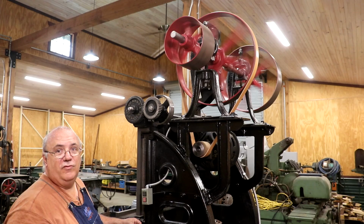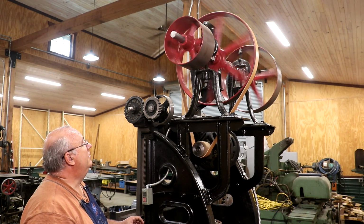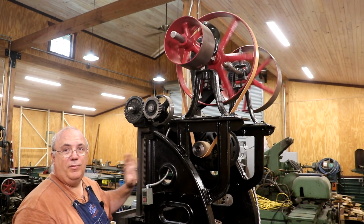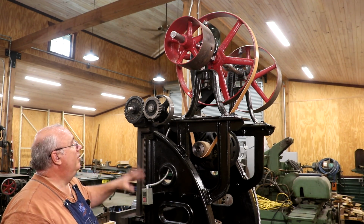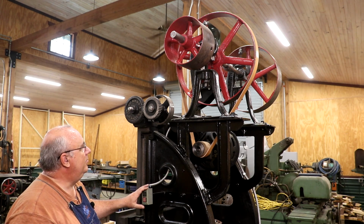If it stopped real fast, that would tell me that I had some tension in there. But this looks real good. That's spinning down real nice. Now, when we get these other ones on here, it'll probably slow down a little bit faster because we'll have a little more resistance on it. But let's move on. We'll get our other 2 belts cut and laced and put on.